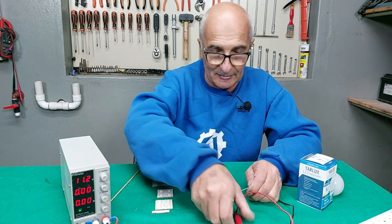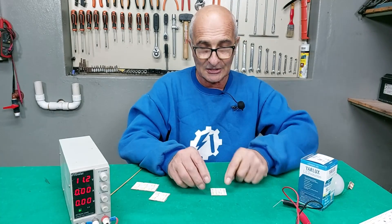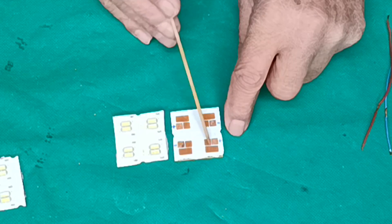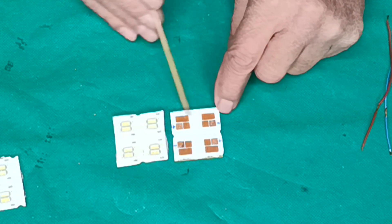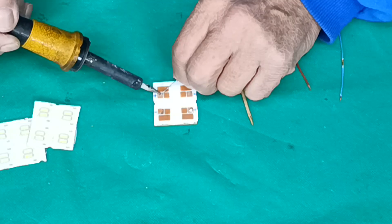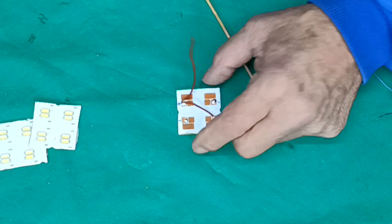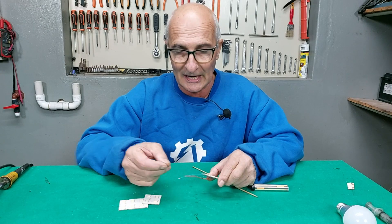Here I've already soldered some small wires — you'll see what they're for. Touching these tips, the LEDs will be working at 12 volts. Here we have two groups of 12 volts. This connection marked here is the negative, and the other is the positive. Each group forms a series for 12 volts, and here we have another exactly the same. Now we're going to put them in parallel so all 8 LEDs work at 12 volts. We'll join the two positives, strip the cable, and now do the same with the negative. This way we'll have our 12-volt lamp.